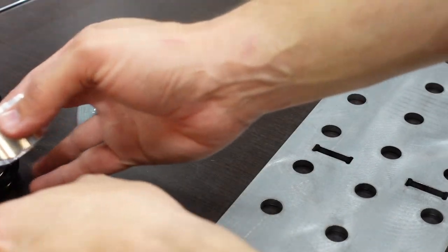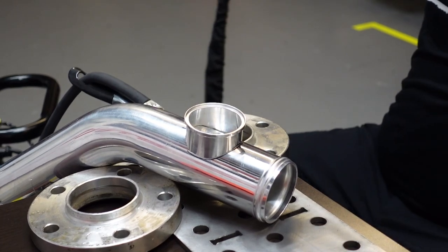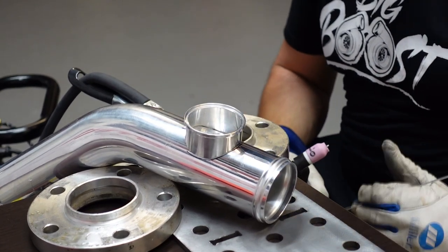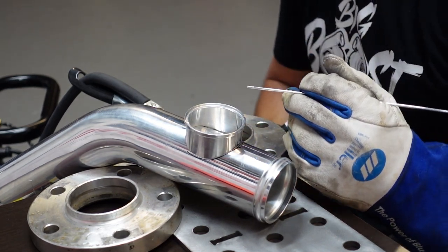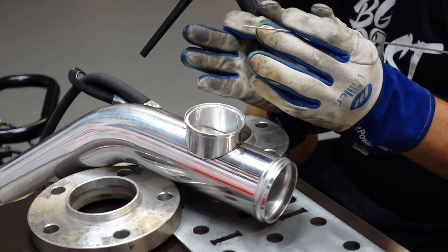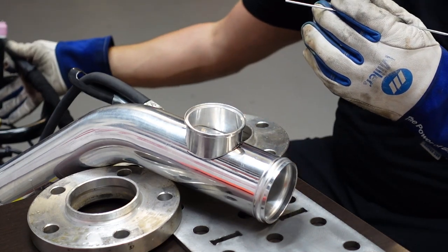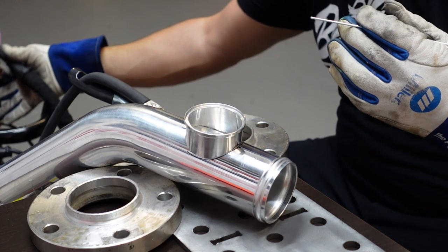We want to remove this black o-ring so it doesn't melt in the process. Just put the blow valve aside — we just want the pipe. I set up the machine to 170 amps so I have full control of the power. I set the frequency to 90 hertz so I get a not-too-thin and not-too-wide arc — about medium size. Then I have my AC balance set to 60 percent.